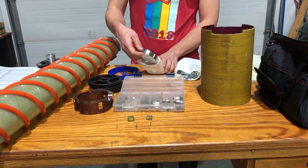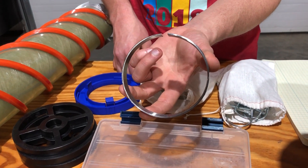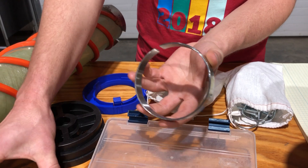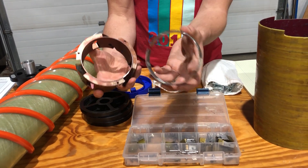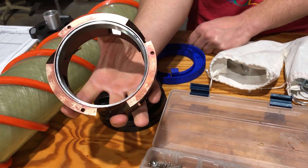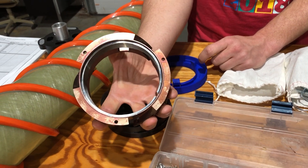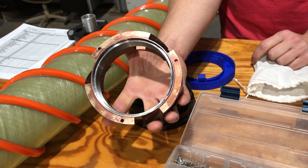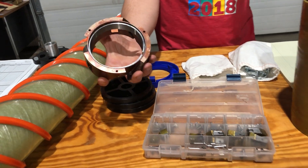The other thing I'll mention with the cutter head is the collets. With every hand auger system we ship some tapered collets that can substitute in place for core dogs. These collets have a one-way trap feature, and the head is tapered along with the collet. When you use a collet, you'll need to remove the core dogs first because they'll interfere with the collet. The collet works best for soft snow and firn and can really help out if you're getting a lot of core dogs streaking — where the core dogs are ripping through the core but you're not catching it.